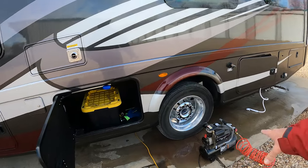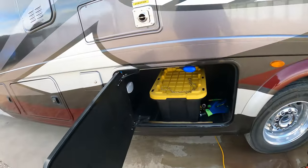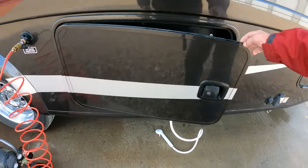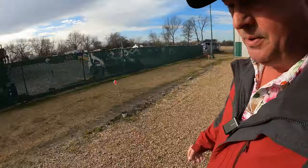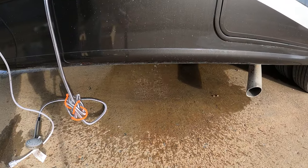So next, before I connect, I'm gonna close some of my low point drains. The reason I'm closing some of the low point drains is I want to focus that air pressure to each individual outlet point in the system. Pressure kicks on to keep up. A lot of water in that one.